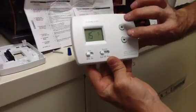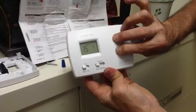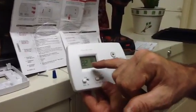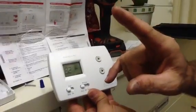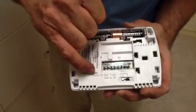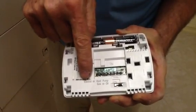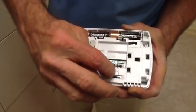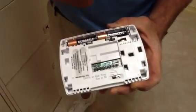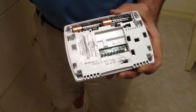I'm going to go back to the main screen — I'll take both fingers. According to this, inside temperature is 82 and it's set to 80. One thing most people forget: on the back of the thermostat it says electric or heat pump, gas or oil. Since we're in Southwest Florida and have an electric heat pump, I'm going to flip it to heat pump. That's gas or oil, or this is heat pump. It has two AA batteries — that's all there is to it.